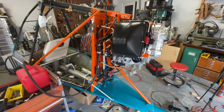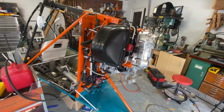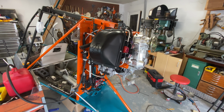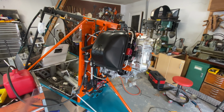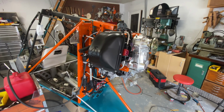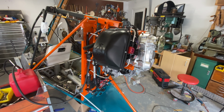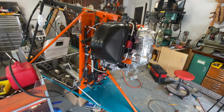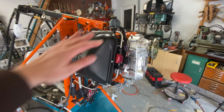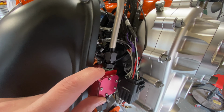The less visually apparent thing that I have done is leak chasing. I have fired up the pumps on this thing a couple of times now and just chased around various leaks and other little issues we have with the fuel system, which is something I was anticipating. There are way too many fittings on this thing to not have at least one of them leak. Thankfully, all of the ones that gave me trouble were none of our nice flared pieces. The flares worked great. However, you'll see this greenish sort of goop here.